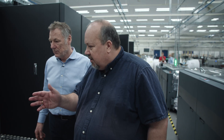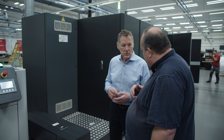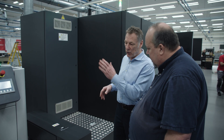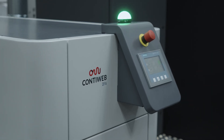Now we are at the end of the machine. In this configuration there is a re-moistening unit. We spoke about how the paper is cooled down, but that doesn't give it the relative humidity back — that is what this unit does. You're re-stabilizing the paper so that the humidity after the moisturizing unit is similar to when it went in, to give you nice flat sheets for finishing.